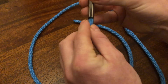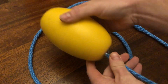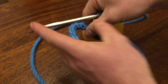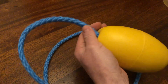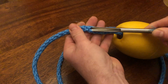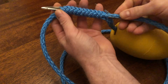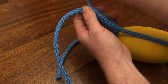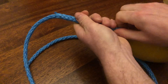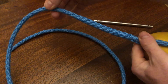Get out the Selma fid again. Push the rope inside, go through the buoy, allow about four or five inches, push it inside the braid as before, pull it through, and ease it back just enough to bury the end. Just one end done - see that, streamlined, nothing to catch on.